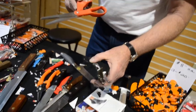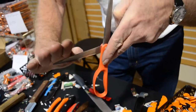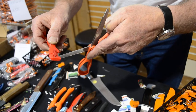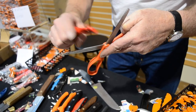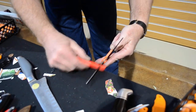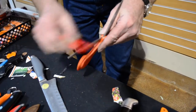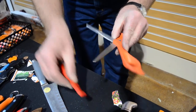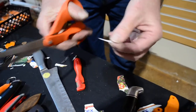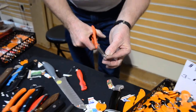So any blade, any configuration, any hardness of blade — all your scissors, pruners, hedge trimmers, grass trimmers, side dykes, tin snips, and scissors — are this simple. You look at scissors, you're going to find their bevel. Tip the bevel over flat to the table, set that on there like this, and brush out. If that's a little too flexible, set it on the table and do it this way. Turn it over, make one flat pass, do it again — one flat pass. Now you're going to end up with scissors that you tuned up yourself that actually cuts like this, clear out at the tip. It actually kicks the paper out of the way — that's sharp.